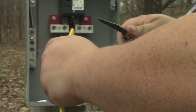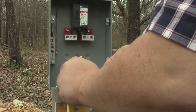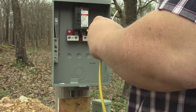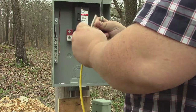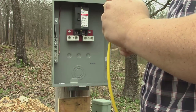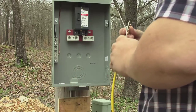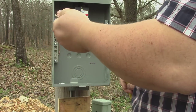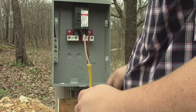I'm just going to come off one side and I'm not going to use anywhere near that. I got 20-amp rated wire and a 20-amp receptacle, so I could go up to 20 amps, but I'll probably never even use that much.